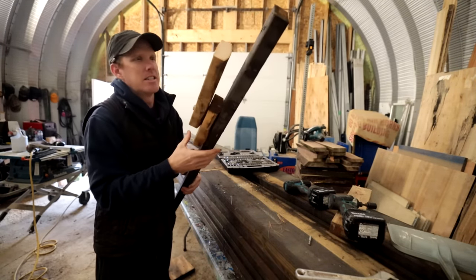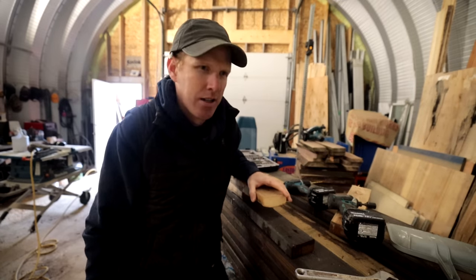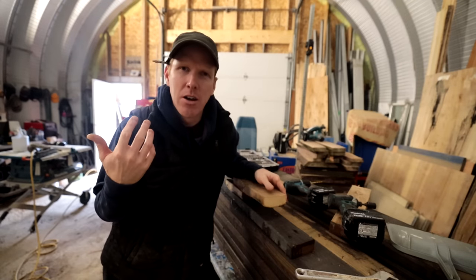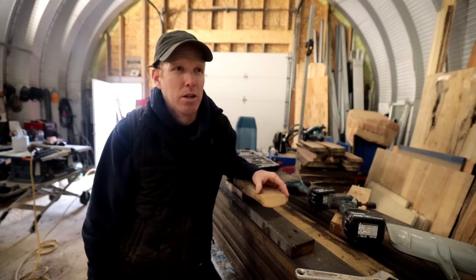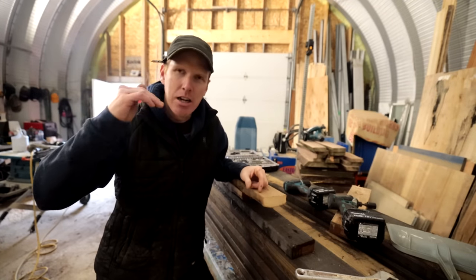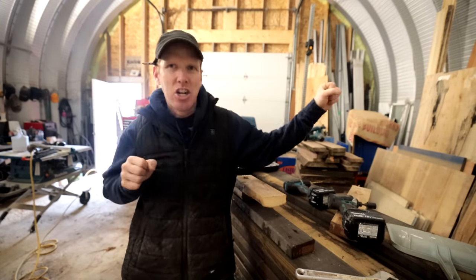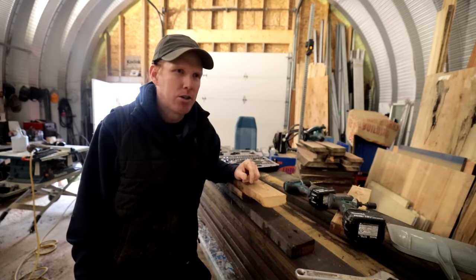It's interesting because there are ways to build alone. It's a lot easier with other people, but there's something about building alone and figuring out how to do it by yourself without getting hurt. I used to hang drywall alone and I would make a T-shaped thing and wrap it with carpet. I'd cut it to just below the height of the ceiling, lift one end, and then jam the T-shaped thing with the carpet on it in to hold the board up.